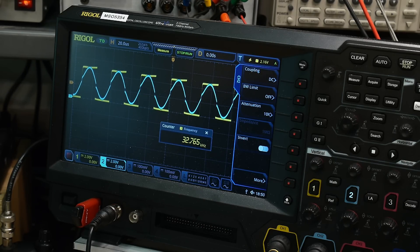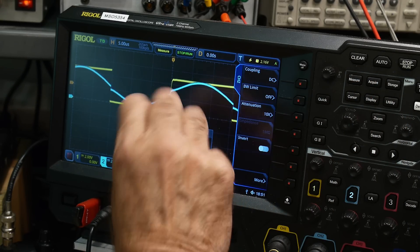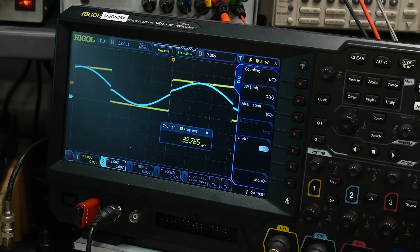Now with the crystal in, look at that — it's much more fancy, definitely more of a sine wave. I don't have a perfect explanation, but it's a resonant circuit. The crystal's reactance changes on either side of its resonant point, so it acts from both sides, whereas a capacitor just charges from one side. It's a very stable sine wave and you can see a little glitch right where it's switching.